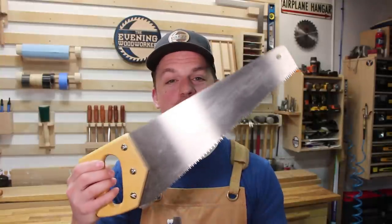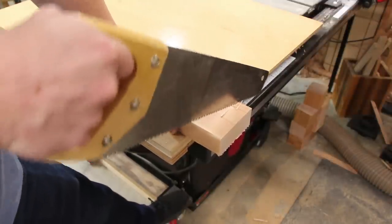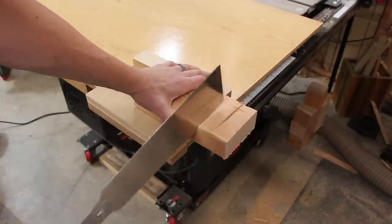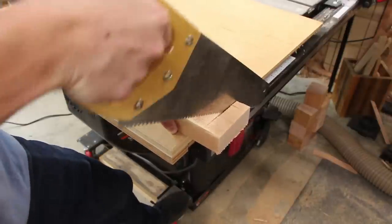The next tool I regret buying is just a cheap hand saw. I got this at one of the big box stores at the very beginning of my woodworking career. I used it and got frustrated because when you're first learning woodworking, it's very difficult to make a straight cut with it. I ended up just hanging it up and didn't really use it. Hand saws are very useful in woodworking but you have to buy the right one. In the same price range you can get a Japanese pull saw, and those are so much easier to cut a straight line with. They cut on the pull stroke instead of the push, so you're not digging in and walking off course.